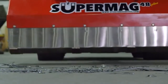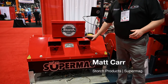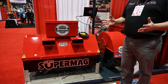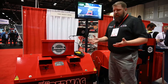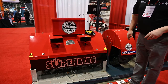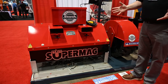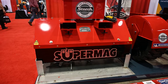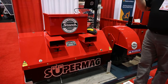The Super Mag is the strongest permanent magnet solution that exists in the world for picking up ferrous metal debris off surfaces. In this configuration, it comes standard with fork pockets and it's a hydraulically actuated permanent magnet — not a traditional electromagnet that requires electricity from an external power source. We simplified it by putting a very strong permanent magnet inside the enclosure. Hydraulically, we lift the permanent magnet from facing downward to upward and back down, turning the magnet on and off. Underneath, there's ferrous metal debris — from highway shoulders, construction sites, or landfills.